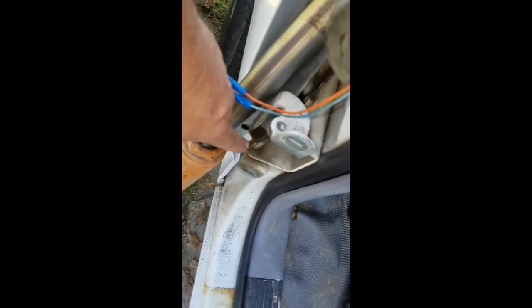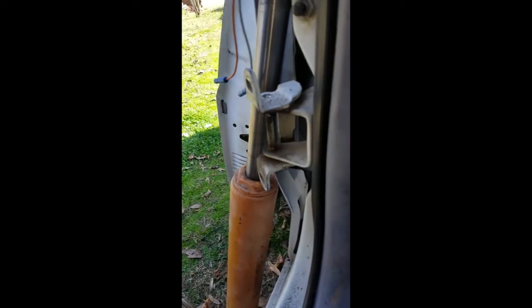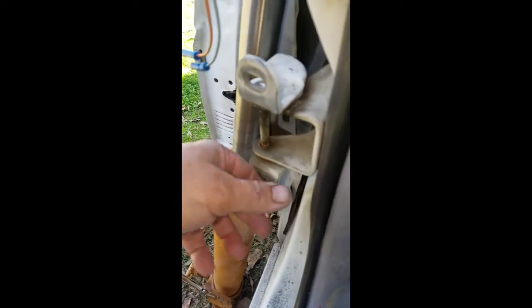I'm going to drill that out. These holes — you can see this hole is going to be damaged a little bit; it looks like it's got some wear on the inside. So when you put that new bushing in there it's not going to fit right. You can either weld it or work around it.